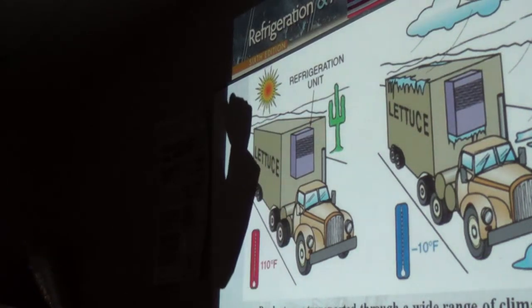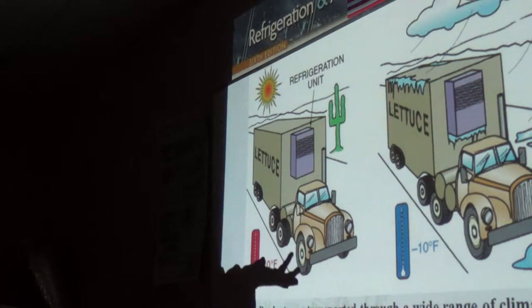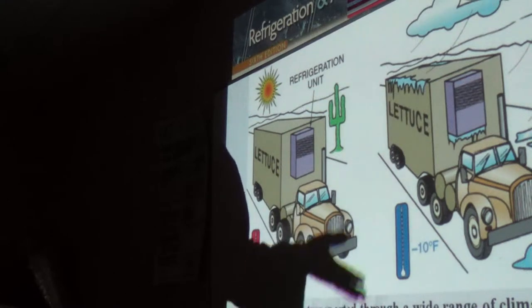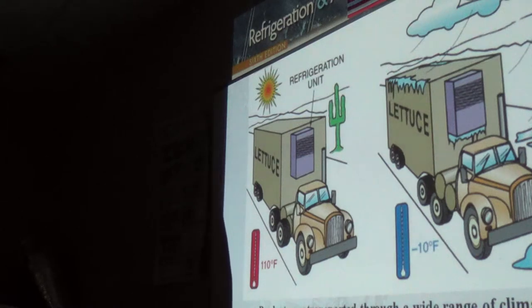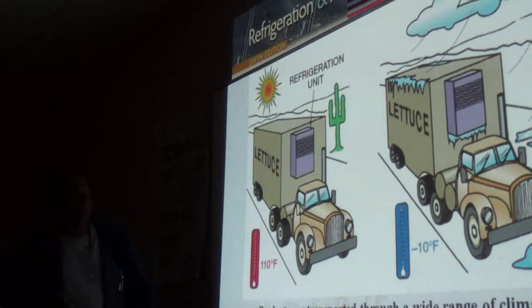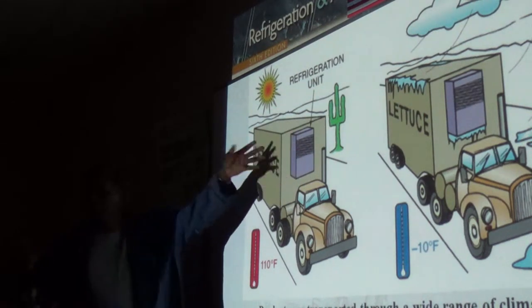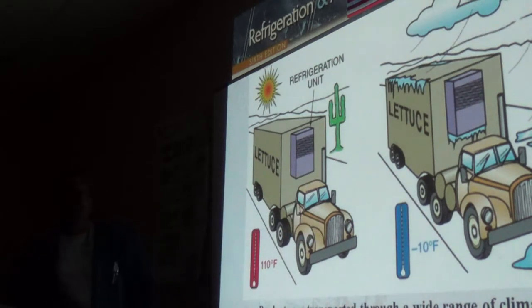With that there, remember, you have time constraints. It's food. All people want to do is get a set of diesel, put it in there, and get the system going. If it can't go because the filter is black, well, so be it. Call the service company. A lot of times you just got to prime the filter so it fills up and sucks fuel fast. But if the filter is bad, call the service company. Well, that's the motor, though. That's right. So this is totally independent, so hopefully it doesn't have as much crap as this fuel will have. Hopefully.